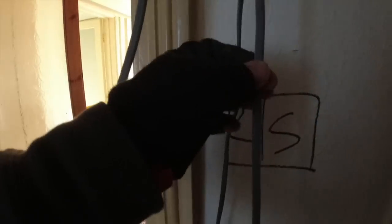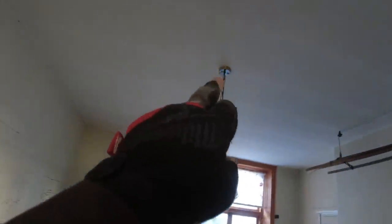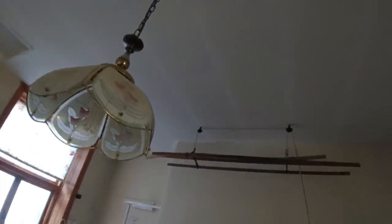That'll do one radial, and a fridge freezer so there's no load on it — we'll do a 20 amp radial. Then we've got a feed in for the lights, feeding into this switch, with a switch line out. First one, we're going to have some LED under-plinth lights and LED above-cabinet lights. We need another feed and switch line out to these cabinets, another one from there to there, and a switch line to a pendant — leaving a load of slack in the loft because this ceiling's going to be vaulted eventually.